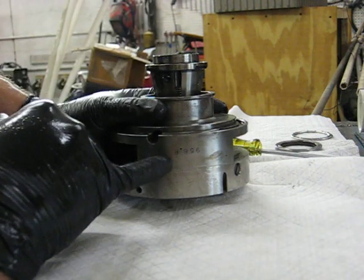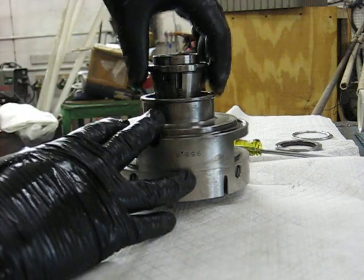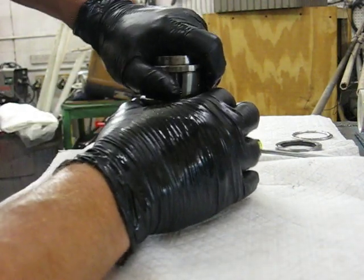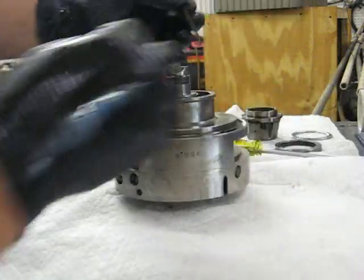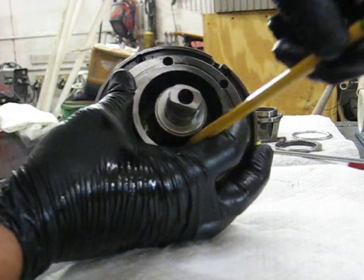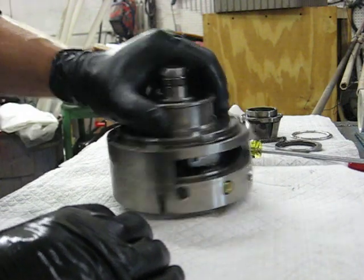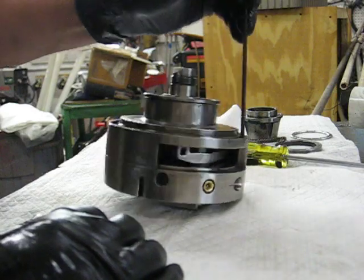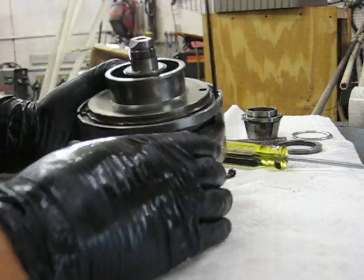Note the serial number marked on the head and also marked on the cone. On reassembly, you want to make sure the serial numbers are in line with one another to get the cone in the correct position. Remove the cone and the two springs that are located on the pins inside. Once the sleeve is removed, remove the 4 socket cap screws on the back of the housing.